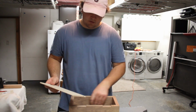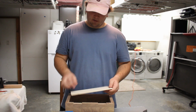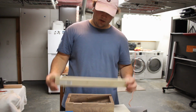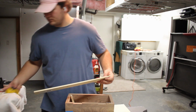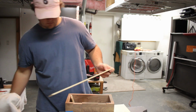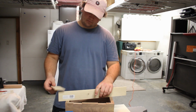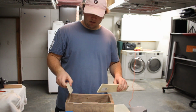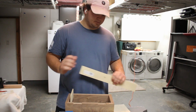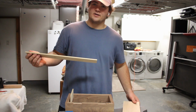This is going to be a 2-layer box. So I'm going to have this be in the middle with a finger hole that you can take out. And then I bought these panels from a home center. They're 2.5 inches wide, so I thought they would be perfect height. I'll cut them down to 2 1/8 inch. That way they'll fit in here nicely, and then there'll be dividers for different jewelry. And I'll do that for both sides.